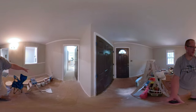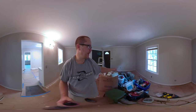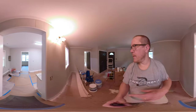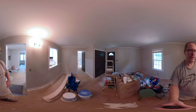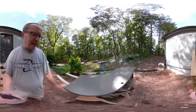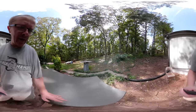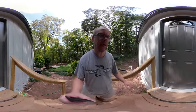I got these baseboards in in this room — there's some weird stuff but I'm going to go around and caulk the joints so that when the carpet guy comes everything's done. I'm going to do this room and the other room, caulk that, and then try to do some electrical things after that. I got to check my list though. I got the door trimmed down and put a coat of paint on it so I wouldn't have to paint it inside the house — once this spot's dry I can take it back inside and it should fit and close.